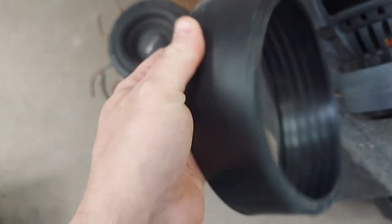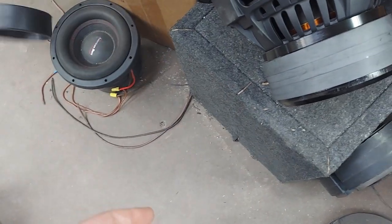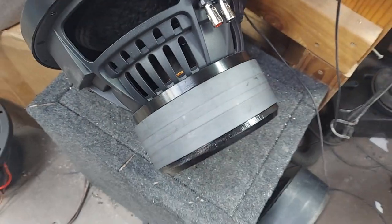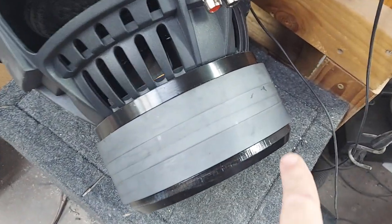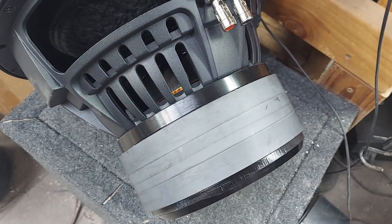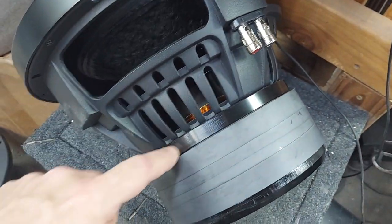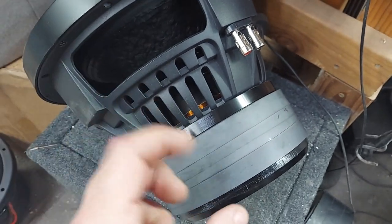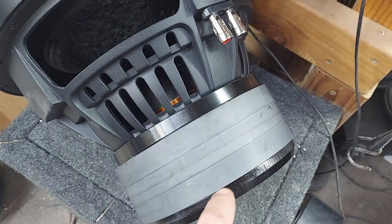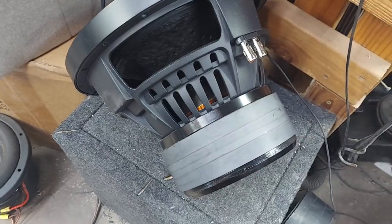It is a triple stack — triple 20-millimeter, which is basically three-quarter inch. You can even see the markings where they did the stamp. You can do a hot forge or a cold forge; it's probably a cold forge, which is cheaper. They actually did mill or lathe this to smooth out the side so you don't get ridges — basically it tears the metal as it goes through the machine and punches it out.